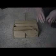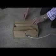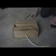Now if you're a number of floors up, and obviously you drill from the inside out, which I'm just using the drill itself, you drill in through, and you can imagine you're up a scaffolding or a pair of ladders. Again, you screw your cable, whichever cable it is, into that bob. You put it on the front of the drill like so, and you just pull it back in again. It's very easy, very quick, it will not come off.